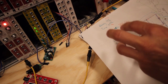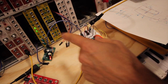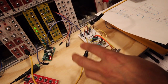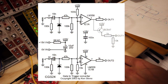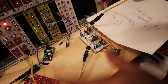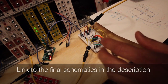After writing those down I change them to the closest standard resistor values — so 4k became 3.9k, 50k became 47k, and so on. Then we just solder resistors in place and don't need the expensive potentiometers. One more thing: right now this circuit reacts on both the rising and falling edge of the pulse and we don't want that. I tried a few things that didn't work, so now I'm going to add the Ken Stone gate-to-trigger circuitry, which will fix this issue properly.